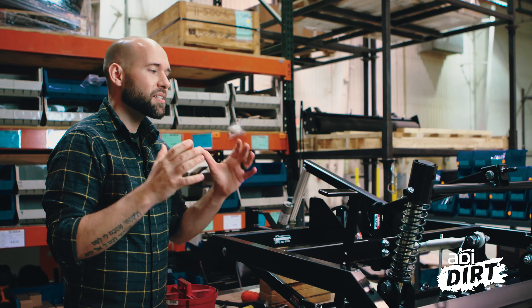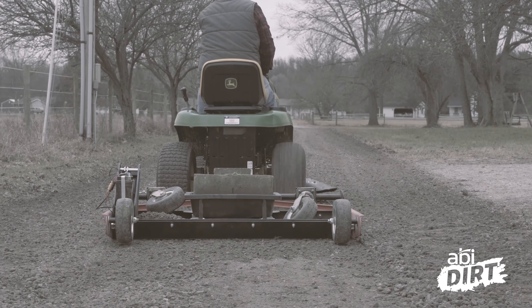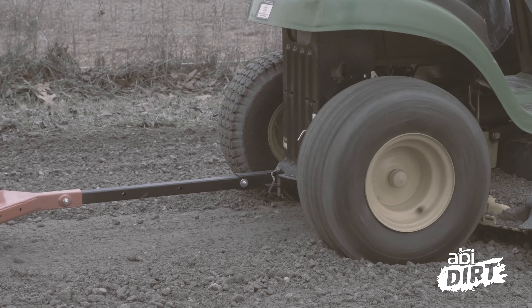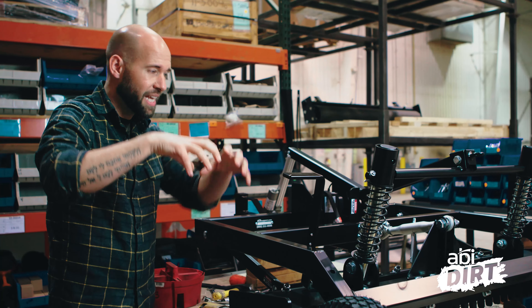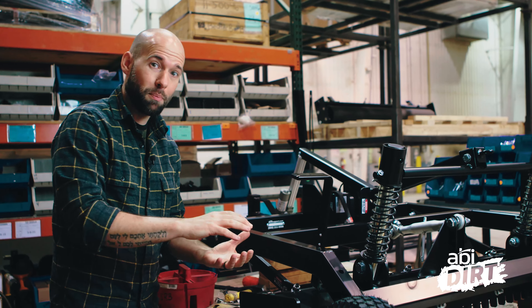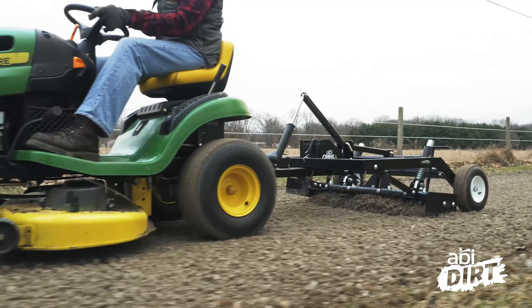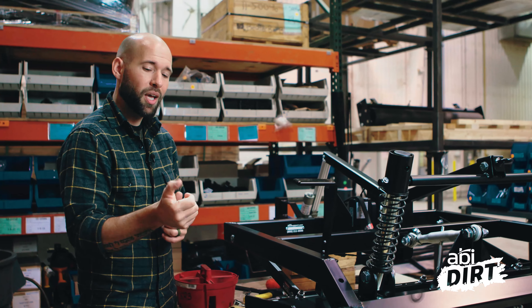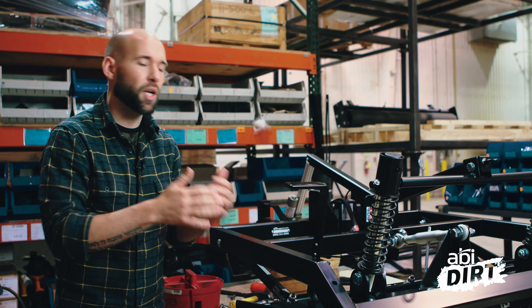The second challenge is slipping. Slipping happens when you've loosened up enough material and begin to carry it on the drag — now there's so much weight and resistance that those turf tires on your lawnmower begin to slip in the loose gravel; they don't have enough traction, and that's not what they're designed for. Once again, back to the compression of these coil springs. In the same way that compression gives you extra down pressure to rip things up, it also gives you forgiveness — as you build up material, those springs can compress, letting the box raise just a little so gravel can let out underneath. And remember, you've got that wireless remote, so even if you've built up so much material that you start to feel the back tires slip, a quick tap on that wireless remote releases the actuator, the springs move up, and you get right back to work — no need to stop and unload additional weight.